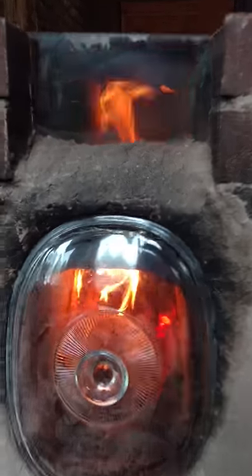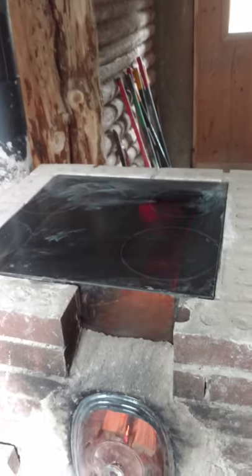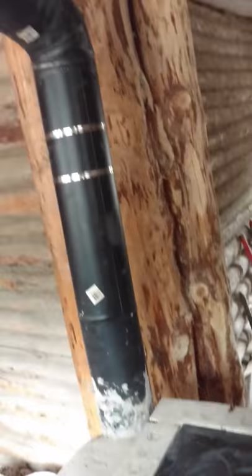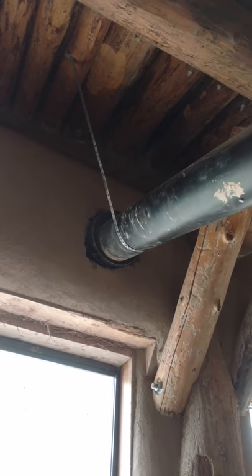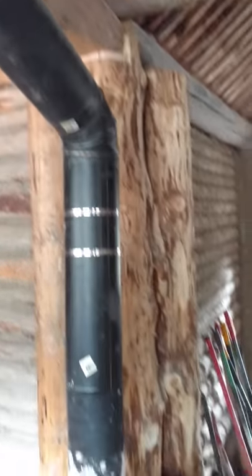So we've been fiddling with this and it looks like it's burning pretty well now. In fact, it's burning well enough that we ended up having to take apart this chimney up here where it went through the wall and put a little flange or thimble around it so that it wasn't going to eventually start that straw bale on fire.